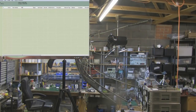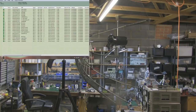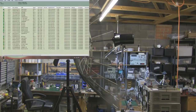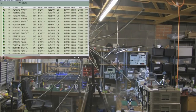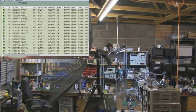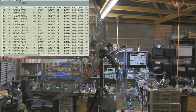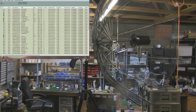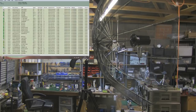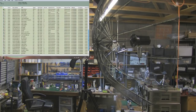Let's give this a go - let's give it a quick scan. I'll start rotating the antenna very slowly 360 degrees. We're certainly getting good signal strength on a lot of those access points. Let's have a quick look and browse through to see how many access points we actually got. We've got 63 access points and a lot of those seem to be pretty good signal strength - most of them in the 70s and above.